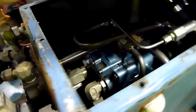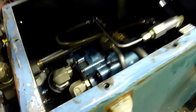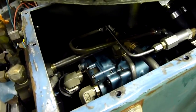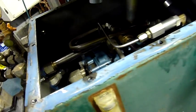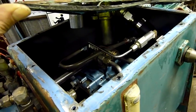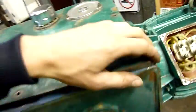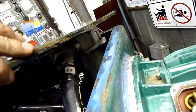I'd be willing to bet this is off something else and they've just modified it to work. I think this thing's going to be bypassing a lot of fluid given the size of that output — that's a three-quarter or one-inch output, which would be perfect for my hydraulic motor. So I'm thinking I might just ditch the PTO pump on the Yanmar and couple this baby up to it. I can't get the lid off yet because it looks like there's a filter element tied in via that big low-pressure hose, but if I unbolt the top, the whole housing should separate.